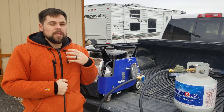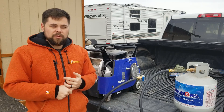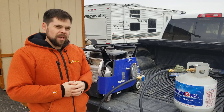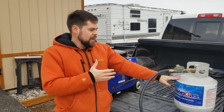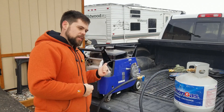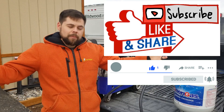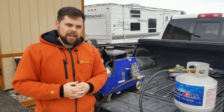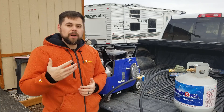Using it in that fashion actually reduces our fuel usage down to like 20% or even 10% of what it would be if we were just using this. For something like an RV, we could still bring this with us and use our solar — but if we're not making enough power from the solar panels, we can crank this on to run the RV or cabin while recharging the Titan batteries. That would allow us to save a lot of fuel, so one propane tank would last a long, long time rather than just a day or two. Inverter generators are much more efficient and very quiet. The propane conversion also means you don't have to worry about fuel going bad like gasoline, it's easier to transport since it won't spill, and it's much cleaner so the generator will last longer. Propane tanks are also much easier to refill at gas stations when the power is out — many just have big propane tanks and it's all a pressurized system with no electronics, so even when the grid's down you can get propane. If you're leery about doing this conversion, look up a small engine mechanic in your area.